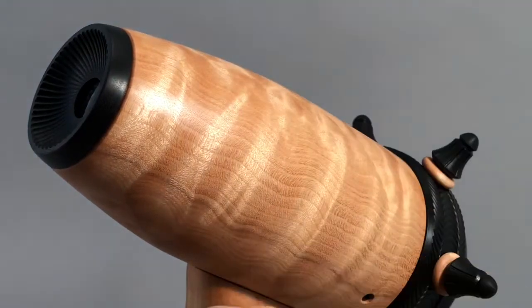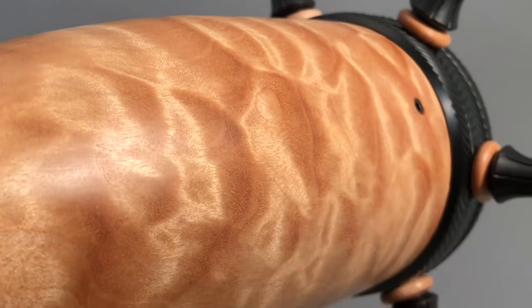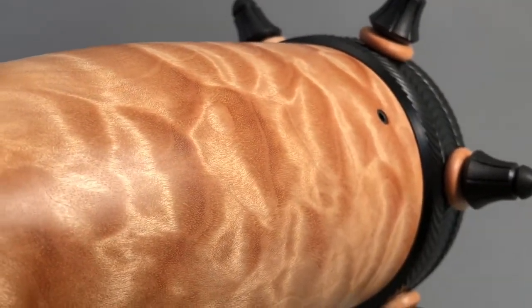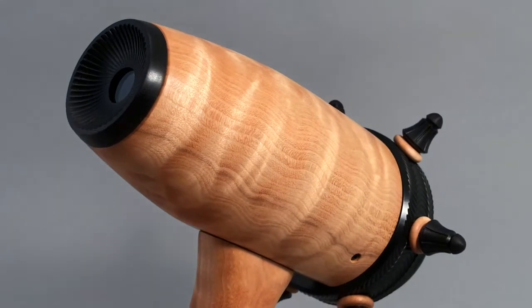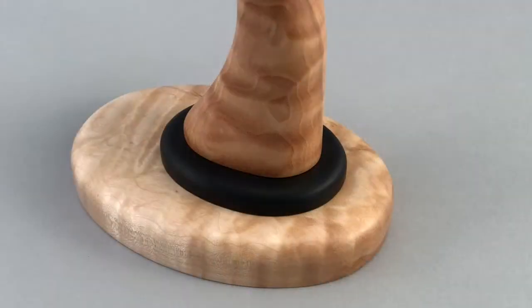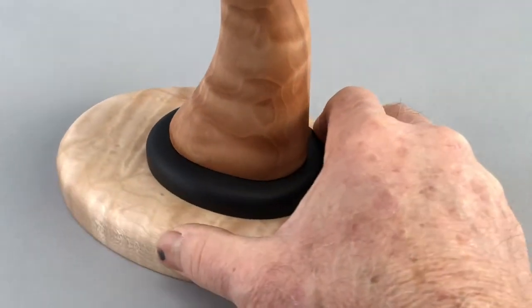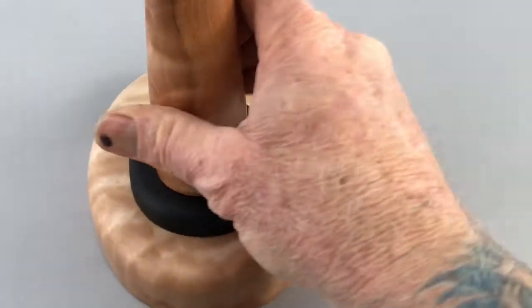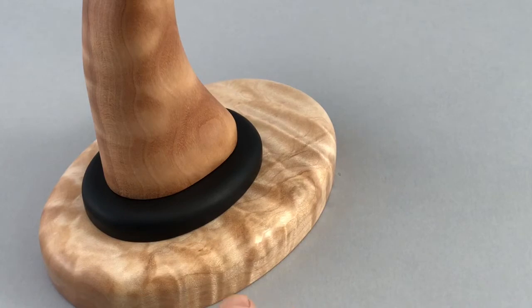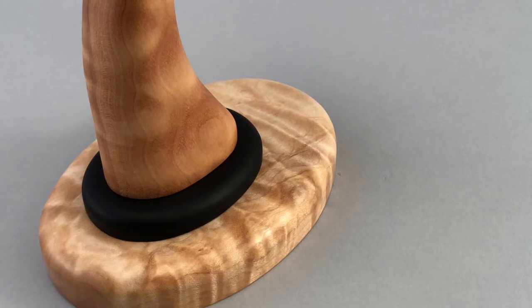This is actually the outside of the tree and this is more toward the center of the tree. The wood on the outside of the tree, if it is leaning out over a bank, it pushes — trying to push the tree upward — and it collapses and makes these folds and wrinkles in the grain. So beautiful. The figure starts to fade away a little bit as it gets inside the tree, and that is only two inches of difference. All the most beautiful wood and the curly maple is typically right out toward the outside of the tree.